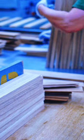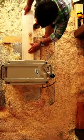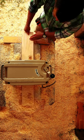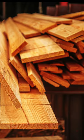The wood you grabbed in the icy air-conditioned store and brought home to your hot shop is, more than likely, trying to adjust to its new home. Cutting or planing the stock at this point will do nothing but give you problems. The board that you planed down and dimensioned at the beginning of the week might be a twisted mess by the end of the week.